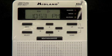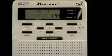And the other step is to set the same code. That's a county code applied to every county in the United States. So the advisories issued for that county will set off your radio. If they're set for every county, then it goes off all night long, and the next thing you know, you don't want this weather radio anymore. You need it set for just that one county.